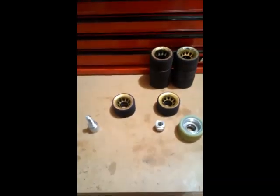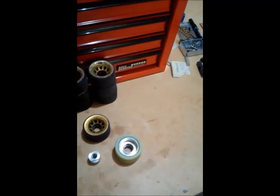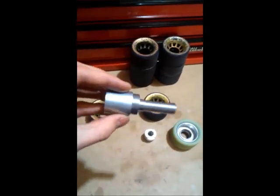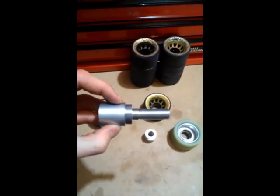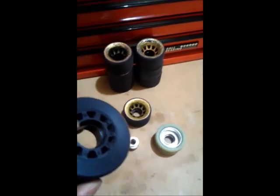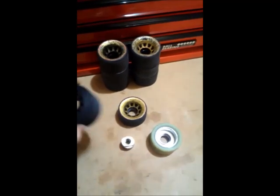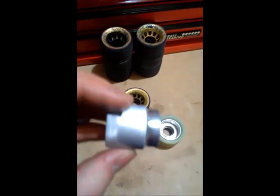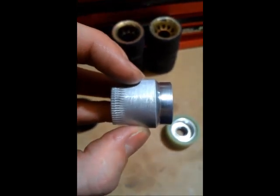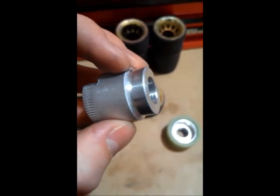This is how I re-groove roller skate wheels, and specifically jam skate wheels. Here's my setup: this part fits in the lathe where my fingers are — that's where the chuck fits. Then this little space right here is where one of these counter-bores fits on. And then there's this part that has this taper right there, and that taper fits into the other counter-bore.